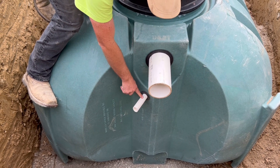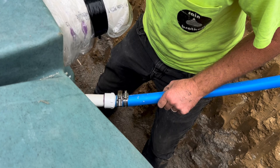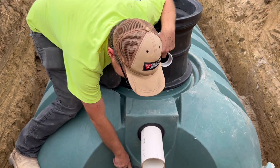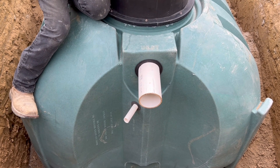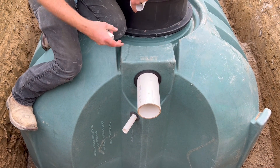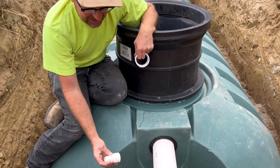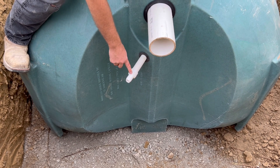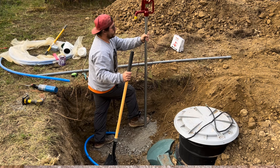Next, we have a one-inch PVC, again schedule 40, coming out of the tank here. This is for our supply line coming out of the pump that's going to feed, in this case, a frost-free yard hydrant. We use rigid pipe going through the tank wall. You want to make sure to use PVC — not CPVC, not PEX, not copper. You want to use schedule 40 PVC. That's going to be iron pipe size, which is what you need for these gaskets. So we're using a nice solid piece of one-inch PVC, and then we're going to glue on our one-inch barbed adapter. Then we can run a flexible one-inch poly pipe off of this supply line that will go, ultimately, to the hydrant.